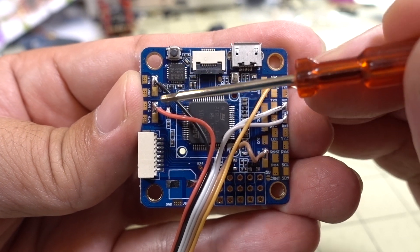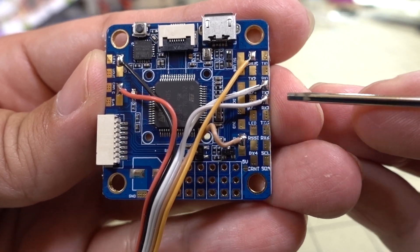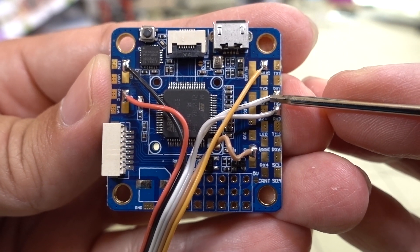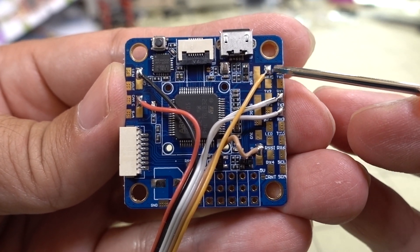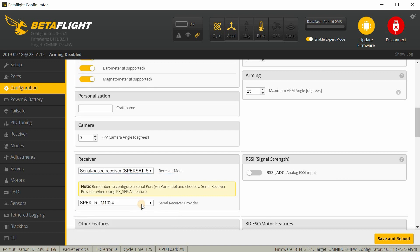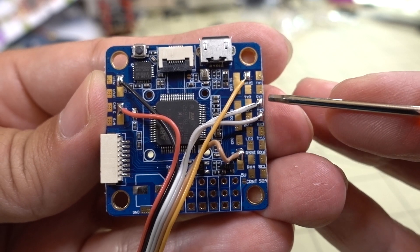So here it is actually wired up. You have your ground over here for power, you've got your 8 volts here for power, your S-Bus yellow cable here, your brown signal ground here, and then here are the two wires for the OSD. You have TX3 going to the RX — that's the white wire — and then you have RX3 going to the TX, the gray wire, for the air unit. For this, you have to enable S-Bus on your flight controller — serial receiver and then enable S-Bus. And then for enabling the OSD, you're going to enable MSP under the ports tab in Betaflight on the UART that you're using. This is UART3, so we'll enable MSP on that. Then you want to reboot, and everything should be enabled at that point.